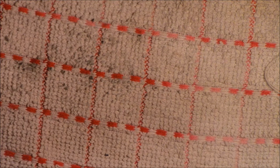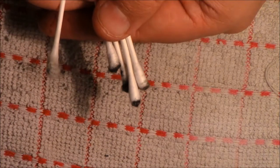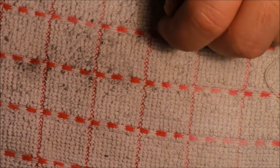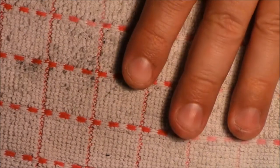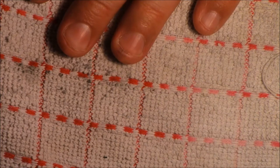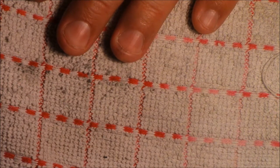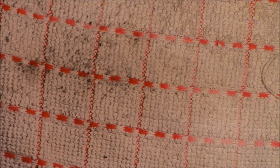Another good practice on anything you do in life — make sure you keep nice and clean and tidy. So I'm going to bung these used cotton buds in the bin and go and wash your hands, because you've got dirt, oil, white spirit, and all kinds of natural oils on your fingers that won't really help the process. Go and scrub your hands, have another cuppa, and then we'll reassemble and test the motor.